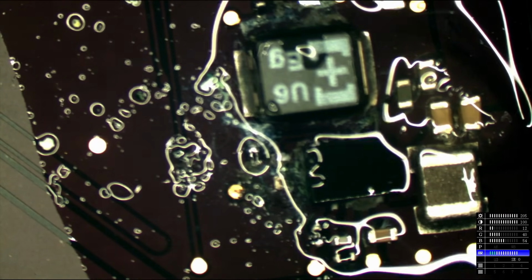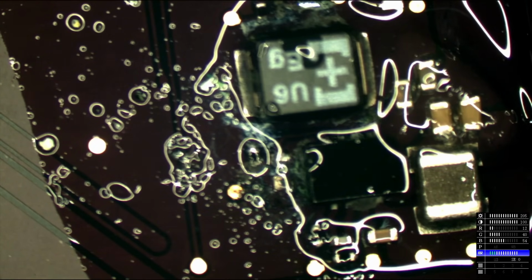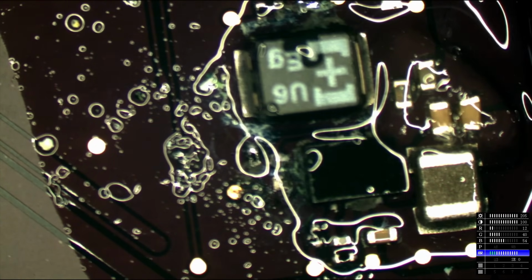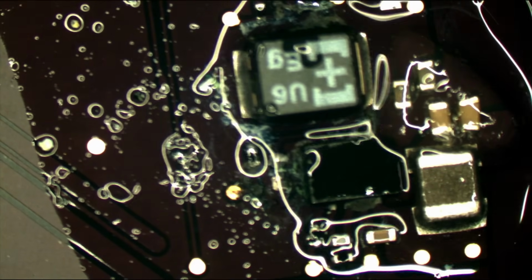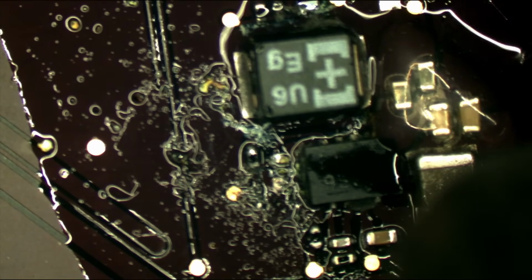Now, you see a solder joint, but then you see this pile of gunk over here, on the bottom of the chip? When this gets reflowed, that's going to go away. Also make sure the nozzle is pointing right at that chip, the little black rectangle. Go closer in on it, even a little closer than that, and hold it there for about 10 seconds.